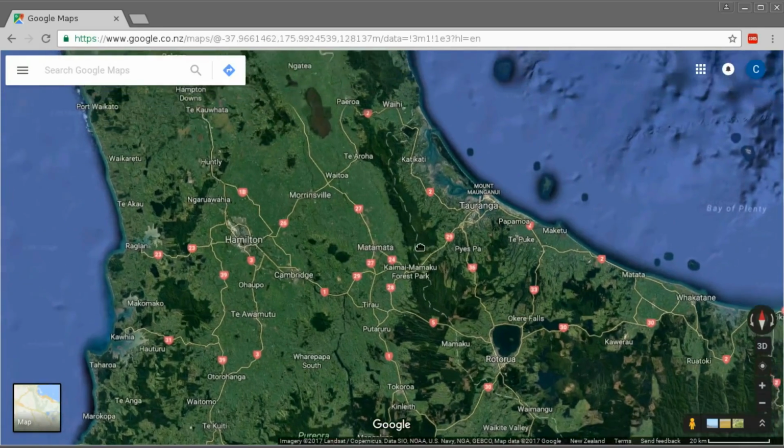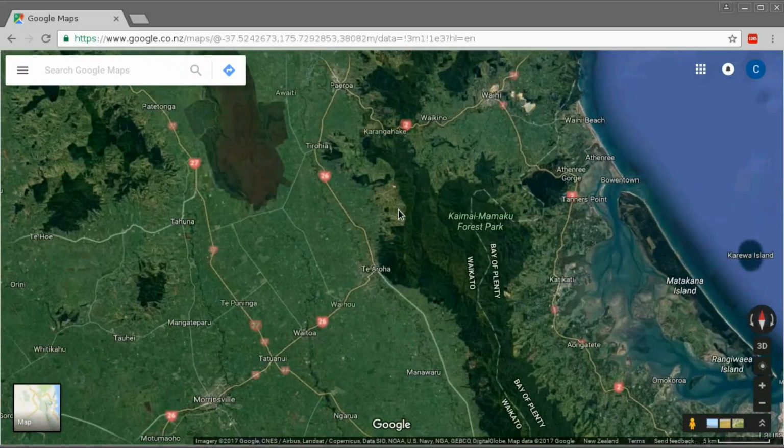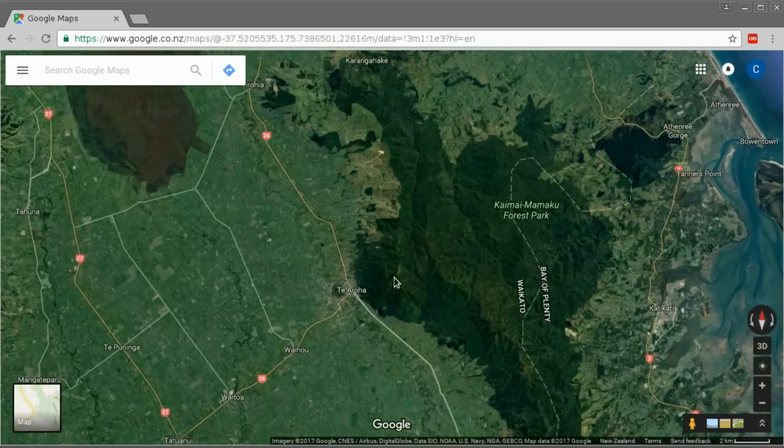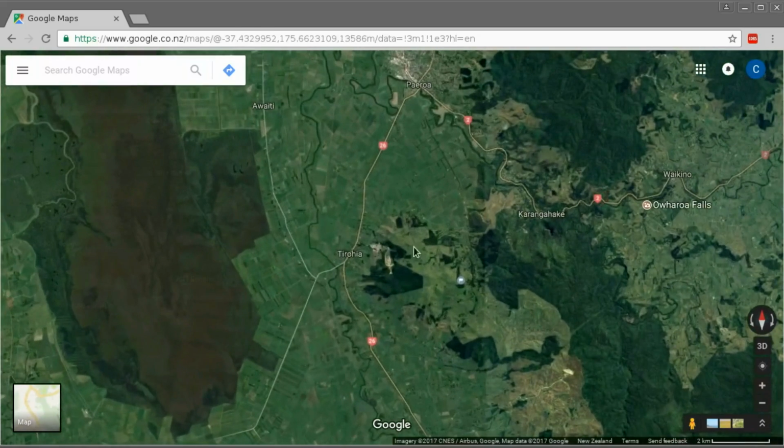Well, it doesn't need to be, but I don't really feel like dragging all my stuff over kilometres of farmland up and down hills twice, because I've got to do this twice, right? I've got to go and pick it up again when I'm finished. So somewhere that you can get as close to as possible by car is what I was looking for. And another thing that you really ideally want to have is a road somewhere along the beam of the antenna, so that you can just drive down that road, and all the way as you drive down the road you are in the beam of the antenna, so that you can just stop at any point and test the signal without having to do lots of crisscross driving just to get a spot in front of the antenna beam.